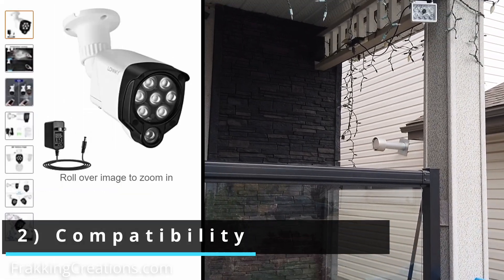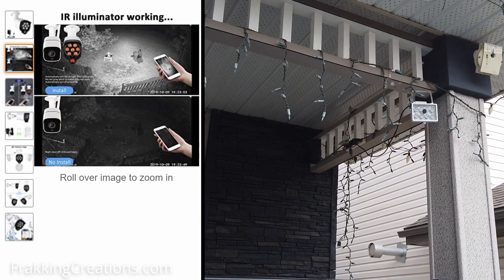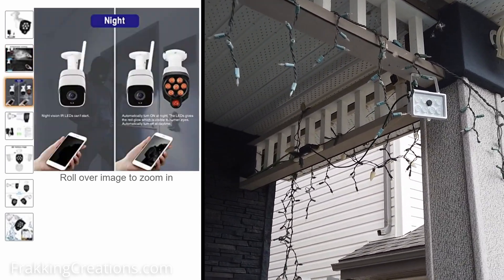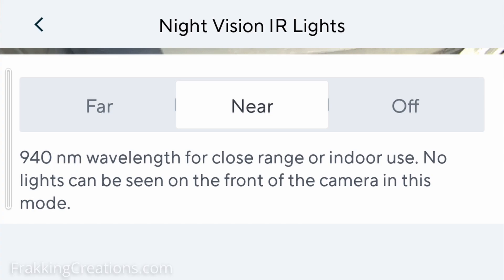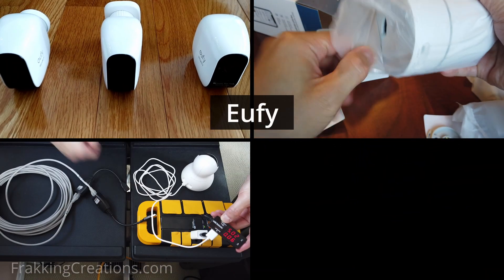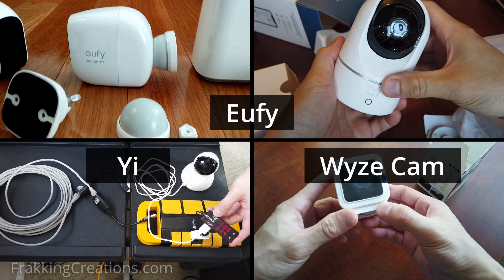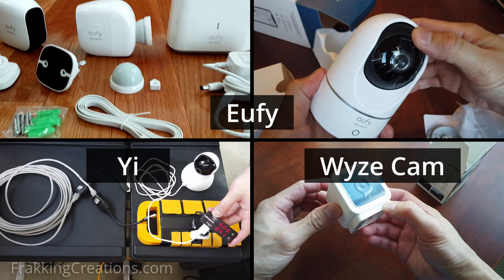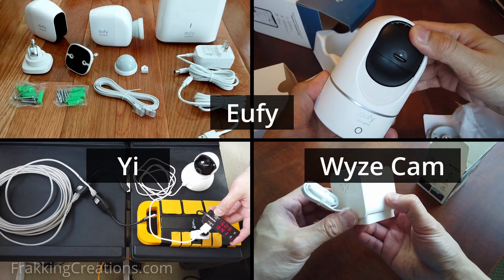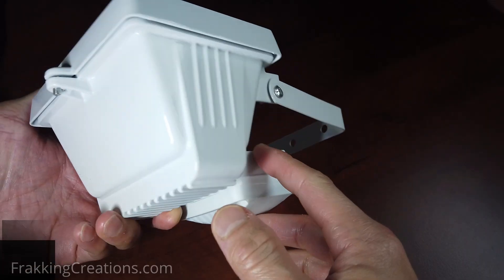Compatibility: if you plan on getting these illuminators, make sure to check the wavelength of infrared light used. Both the illuminator and security camera should use the same wavelength. Most are compatible with 850 nanometers, like these ones, which work with our Eufy, Yi, and Wyze Cam security cameras. For cameras that don't work in the same wavelength, you may see that it is only slightly visible, like in this DJI Osmo pocket footage. So make sure to check what your camera supports before purchasing one.